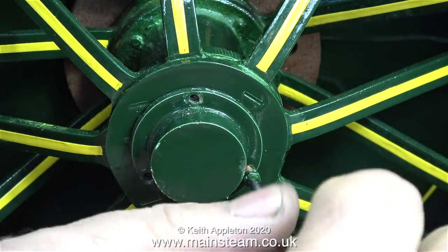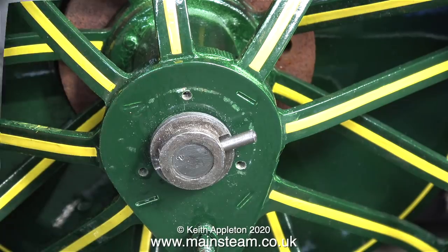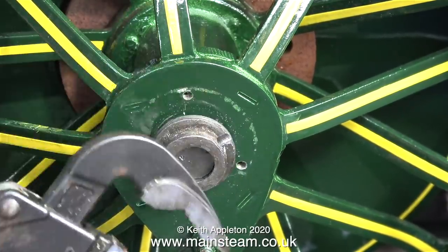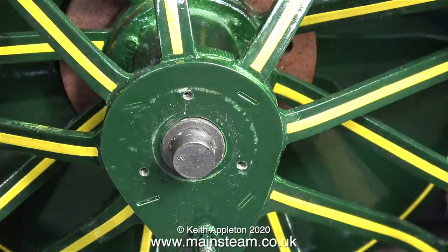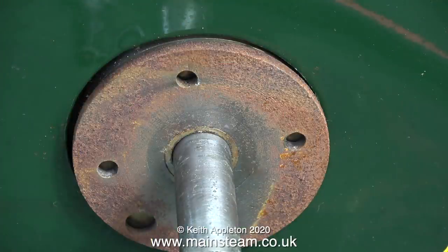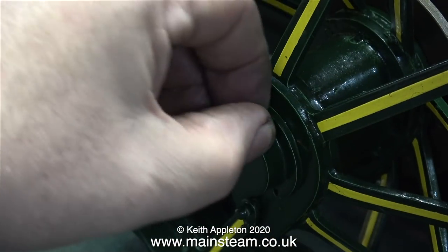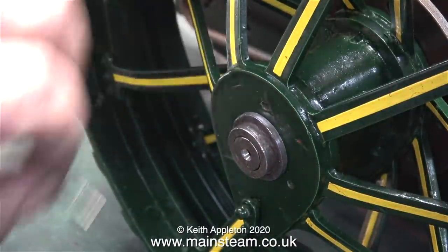Removing the wheels is a very simple job. First of all, you take off the top cap. Then you see a collar with a taper pin through it — you tap out the taper pin. Then you use a tool that looks like a cross between something from Jurassic Park and Alien. This is a Barco product and it's very good and very easy to use. The collar was tight at this side but it's no match for my Barco wrench. This is the drive plate and it has holes in it that accept a peg from the wheel. Behind this is the differential gear, and as that seems to be working fine I'm not going to mess about with it.